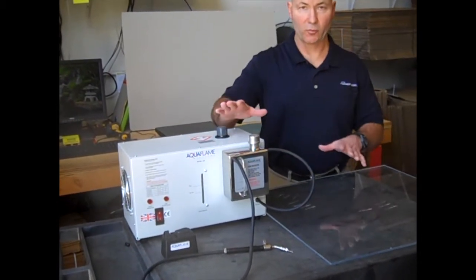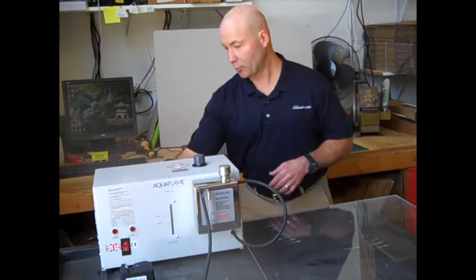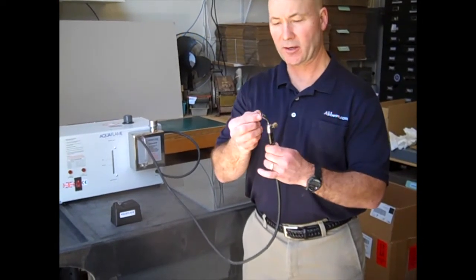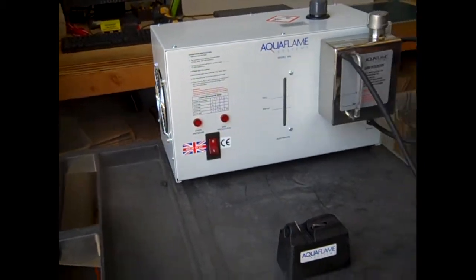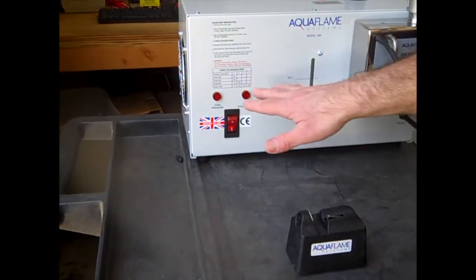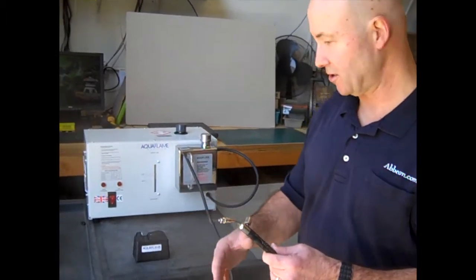By the way, on this MEK — after we run it, we're going to start it up, run it for a little bit, and then come back and top up the MEK. We can top up the water as well. So right now we're going to plug in the machine. Before we turn it on, the torch must be closed. We've got a number 20 tip chosen for this — the size of the tip will determine the area that you can polish. When we're ready to open up the torch and polish, this gas production light will blink periodically. Once we open the torch, we're going to give it a minute or two for the gas production to take place and make its way to the torch before we light it.